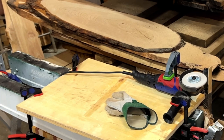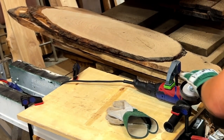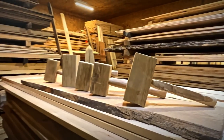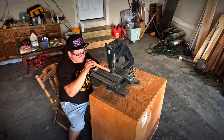This has got to be one of my favorite parts. I first cut out the rough shape with a grinding wheel, then come in with a flap disc grinder and shape it to give it that hand-hewn look you see in the mallets. The video doesn't do them justice — these birds-eye maple handles are truly one of a kind.